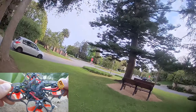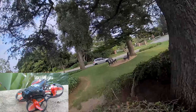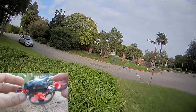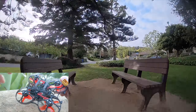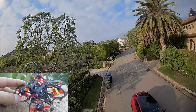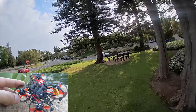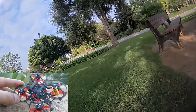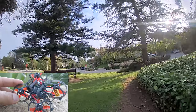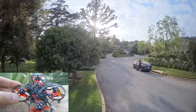Piroflip has sold hundreds of these things, and there is a stack of about a hundred in the corner of the shop that Happy Model is not supporting, which is weird. They have all burnt out because the boards just don't hold up, and it's really unfortunate. It used to hold up in the earlier batches, but it doesn't hold up lately with 2S or 3S. With 1S it holds up great — it's really hard to burn something when you're not even running above 5 volts. So because of this one annoying flaw, I really can't recommend this quad because it's not cheap, and if it burns out you do have to kind of rebuild the whole thing. You might as well just wait for somebody to make a board that doesn't burn out.